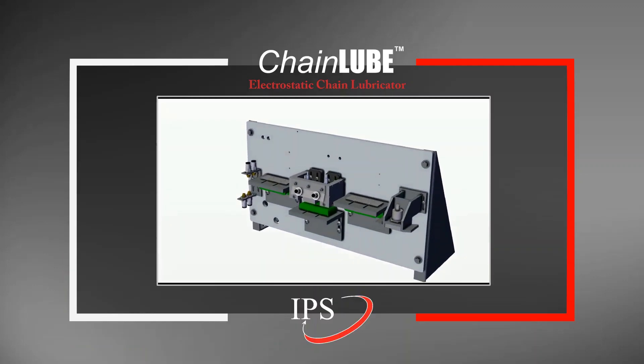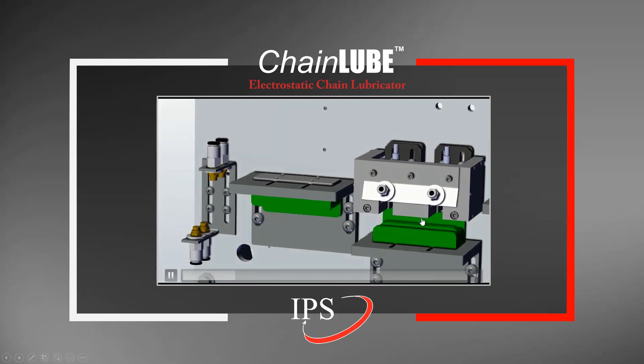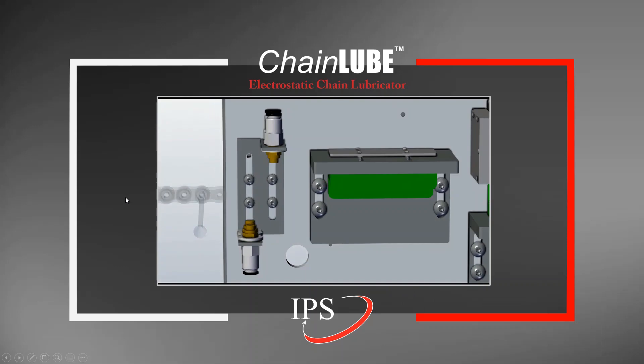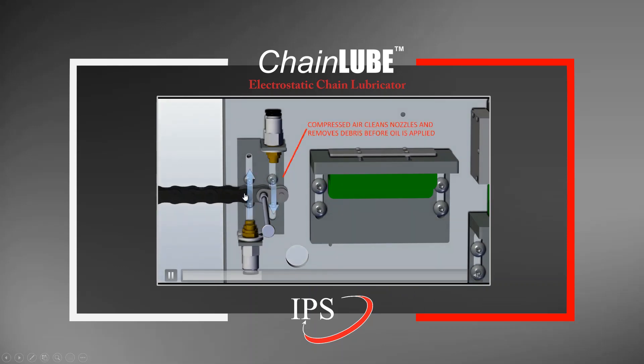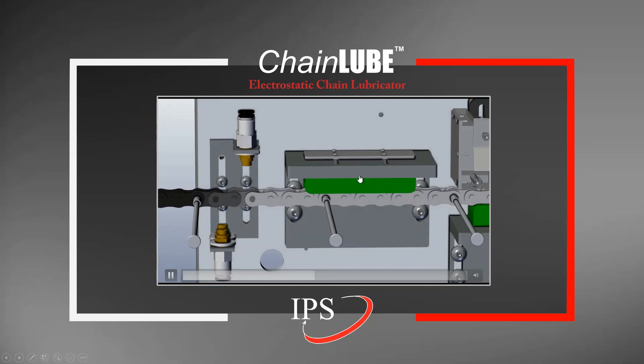In this animation, we will show you a bit more detail of how the chain lube actually works. These are the cleaning nozzles, and these are the lubrication nozzles. It starts when a pen chain enters the system — this would actually be a closed loop, so there would always be pen chain in the system. The first stage is cleaning the dirty pen chain, after which it is controlled through the guides that are integrated throughout the system.